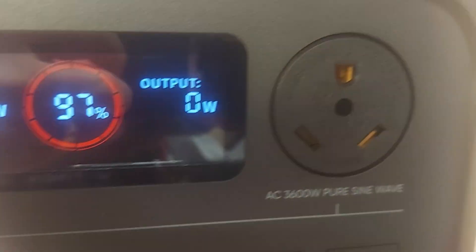This thing weighs 77 pounds. It has four 120-volt plugs on the front and a 30-amp 120-volt RV-type plug you could use for your house, RV, or whatever. It's got four USB ports — two USB-C and two USB-A. There is no cigarette lighter port and no light on it. This is not your typical camping power station; it's really designed for home use during an outage. It also has an AC expansion port on the side and a DC expansion port — with this unit you can expand it to 21 kilowatt-hours and parallel two units together to get 240 volts.